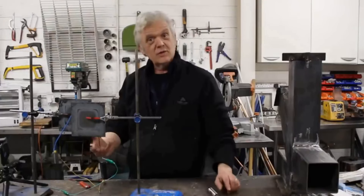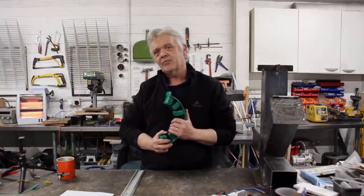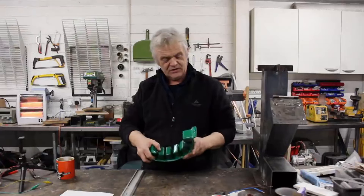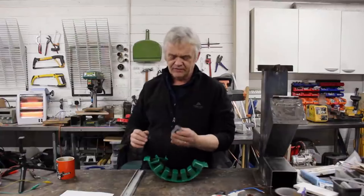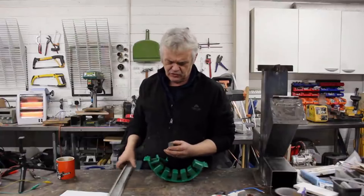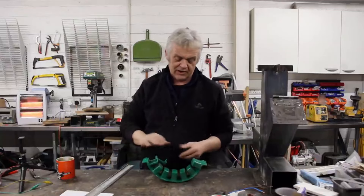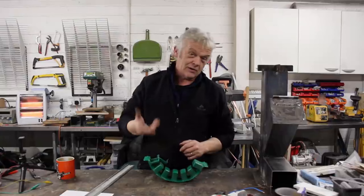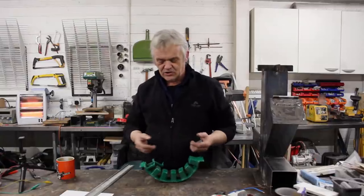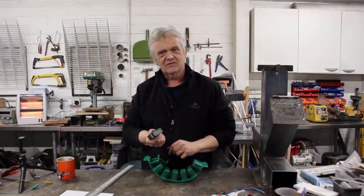These are a set of magnets that were put around the pipes of hospitals for demineralizing water — quite a mighty set. If we slice down and open it up, we can pull the magnet set out. What we get are four ceramic magnets, roughly 2 cm by 5 cm by 1 cm thick. So we have a whole load of magnets. What we're going to do is make an MHD generator — let's slice them out. They come out as a block and separate relatively easily, and we need about 20.